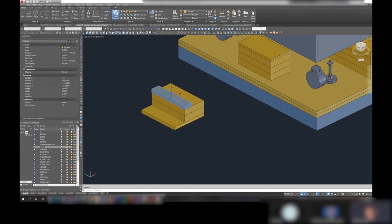This is the stopper. The stopper will be nailed on the LBM. Okay? Then below, there is an attachment for the packer to ship in and out. Then they will lag on site. This one will not be fixed in the factory. The factory will do this blocking only. Everything they will nail for you, but send loose. So the packer will go and match on site, then tighten two leg screws, set up. Very straightforward. Tighten directly to the floater.